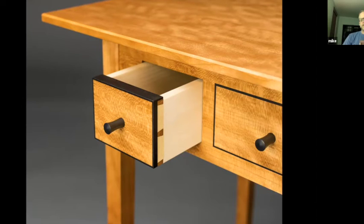I don't have photographs of making the cock beading — I apologize for that, just didn't think to take any when I was doing it. But it can be finicky stuff. Probably the biggest challenge when doing cock beading is where the side pieces intersect the top, because the top piece of cock beading is as wide as the drawer front while the side pieces are not, so you end up having to do a little stopped miter cut. And in this ebony — it's brittle, it's dense, it's just kind of tough to work — and you're working with these tiny little pieces.